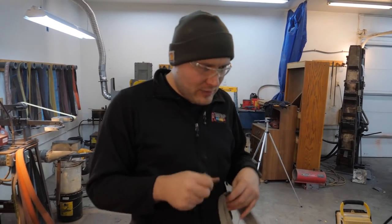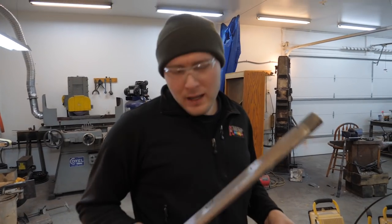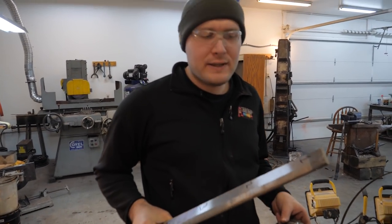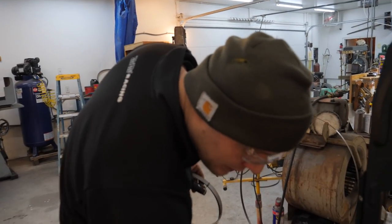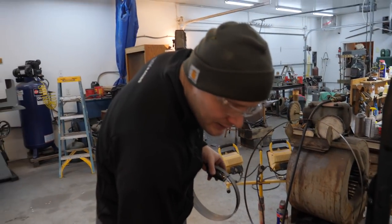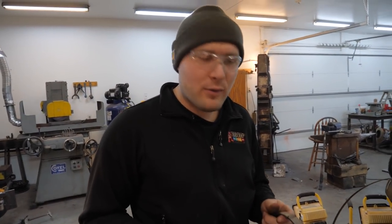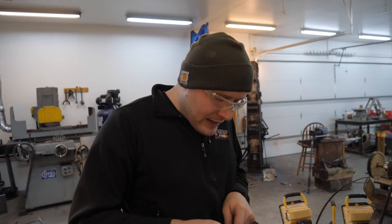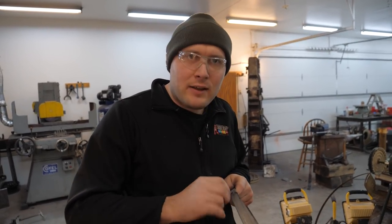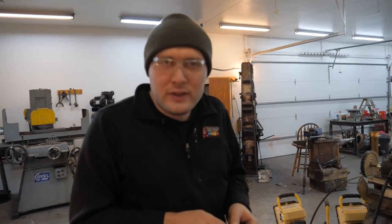Ready to slap a brand new blade on this bandsaw. This is the W billet — got it all ground clean, got it marked out. I'm gonna cut it into four pieces and we're gonna stack it up. We're also gonna put some 1084 in between the layers to add a cool effect. We're gonna surround this in metal like we did with the other billets to keep oxygen and atmosphere off the billet completely.